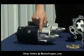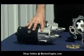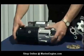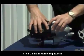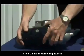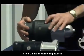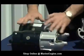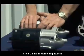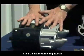The marine starter is also sealed at certain points to keep water from intruding into it. You can see that on this case there are spot welds to keep the case from splitting under usage. The automobile industry does not do that welding, so under use this can actually spread apart and allow sparks to enter into the bilge. Anytime you get sparks entering into a bilge, that is a bad situation because that's when explosions can occur.